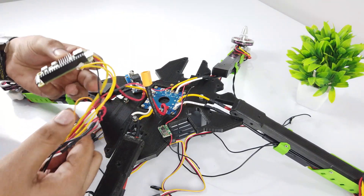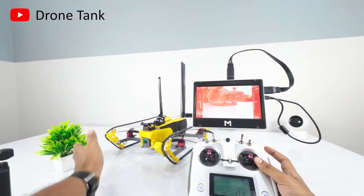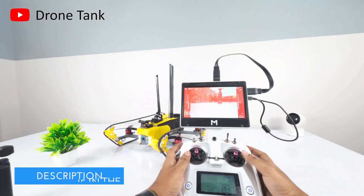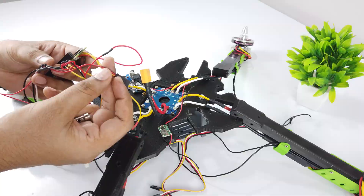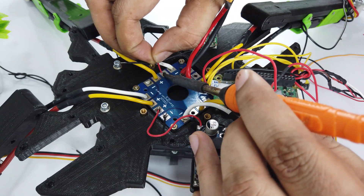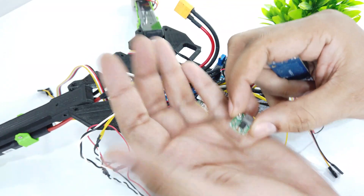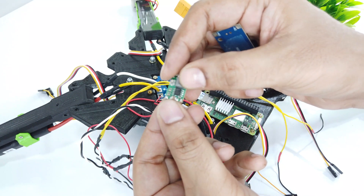This is the Raspberry Pi of the OpenHD video transmission system, as seen in my previous videos. If you haven't checked out that video, you can click on the i button and watch it. All the parts links and wiring diagrams can be found in the description. These three pins are for the gimbal servo motor. Let's solder the wire of the buck converters. As I connected the battery, the main IC of both buck converters got fused because of reverse polarity, so I have connected new ones. These converters don't have reverse polarity protection.